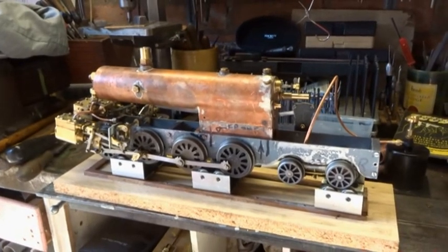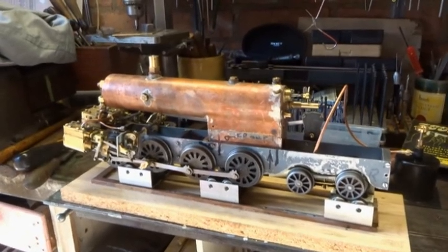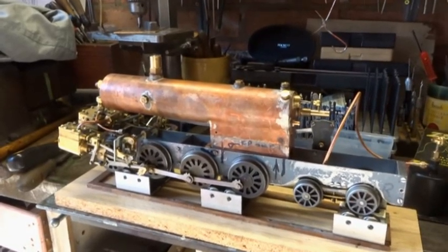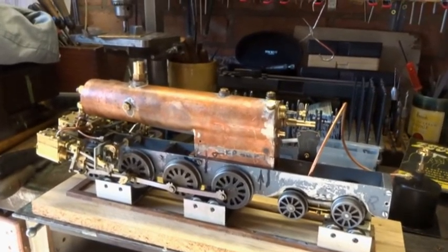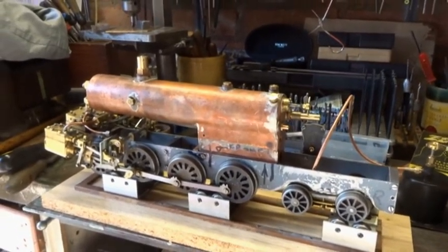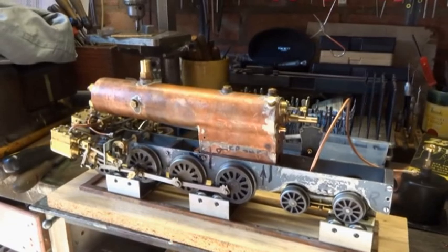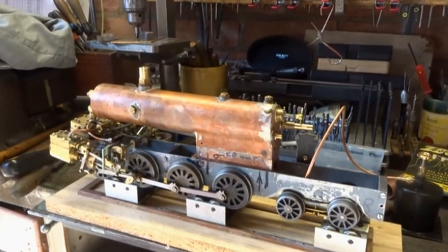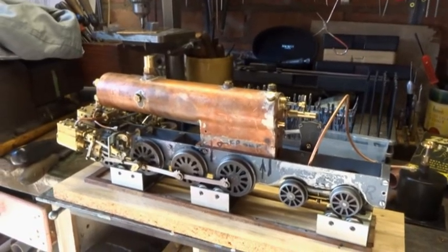Unsurprisingly, I decided, because the burner worked well in the air, that the problem was insufficient oxygen around the burner to give proper ignition. And of course the reality is that the firebox had been designed for spirit, and it was a bit of a wheel to get a ceramic burner in. I think I originally put the burner far too high in the firebox, and that's why proper ignition could not take place.